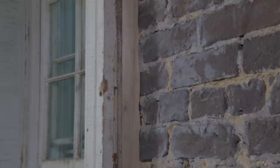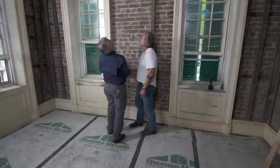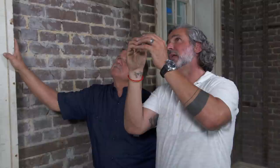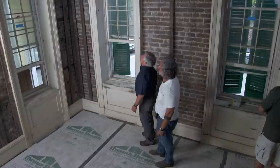It takes some time for the carpenter to get that scribe. It's ready to get client approval — he's got to sign off on this and also on our ceiling detail. The idea behind it was for our new ceiling to read as if it's the original flooring from above, but that's not practical. We need acoustic insulation. So we've done rigid insulation, put up a little bit of a nailer, created an air pocket for additional sound, and then very simply got six-inch pine and lined it. The homeowner can either stain, whitewash, or paint it to contrast against the beams. The beams — we're just going to light hand sand and pull the nails. That's going to really look good.